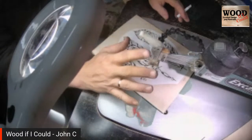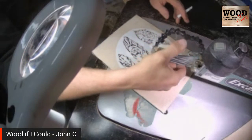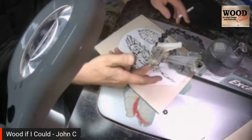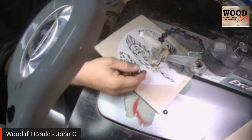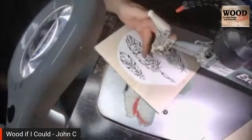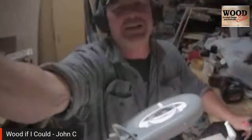Shay, when you leave your saw at night, try and pull the tension off your saw so that your blade isn't still tight. If you leave your blade tight, it actually stretches your blade, even if it's a good blade. So you either pull the tension off or make sure that you just undo your blade if you leave it for the night. Well, right. I bet that blade I got in that saw stretched from here to Dallas. Well, it's been that way for 2 years.